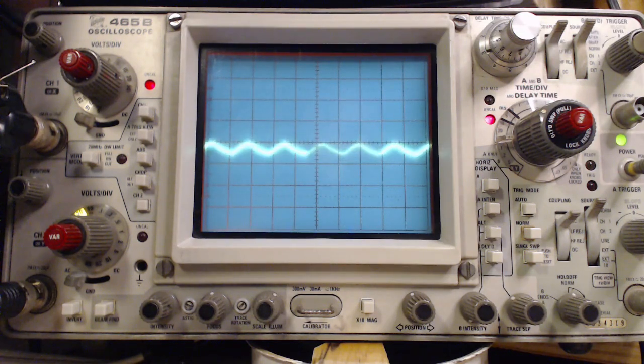So, I am going to hook up that capacitor, but I'm going to do it first by turning off the power. And now we're going to hook up a 1,000. What are the risks of hooking up a 1,000 where you want 500? Now there's going to be 1,500. The risk is during the charge up of the 1000 and the 500 together, it will burn out a resistor. What is the degree of risk there? These are high wattage resistors. I'm looking right at them here.